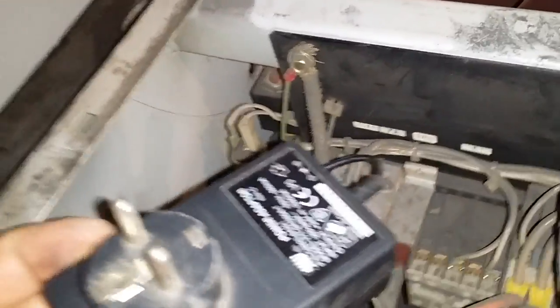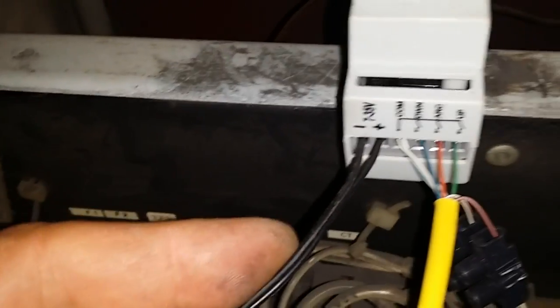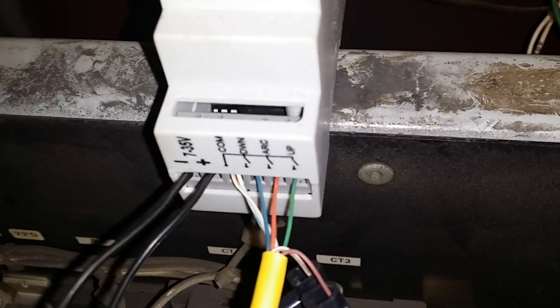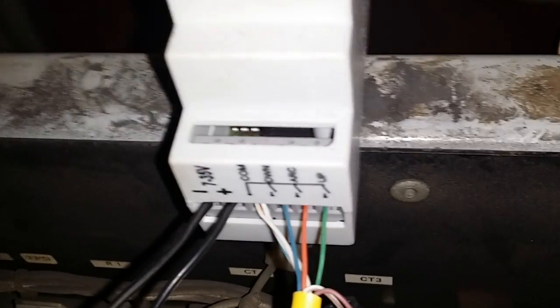On the other side there are signal wires. You need a transformer — since it has a wide range of power requirements, it can do anything from 7 to 35 volts. So these are the two black wires. After that you need four wires for signaling and one as a common for arc-ok, up and down signals.